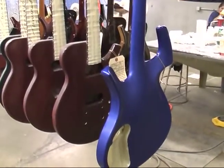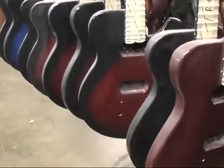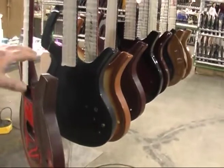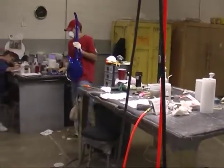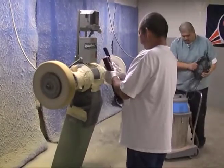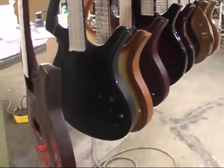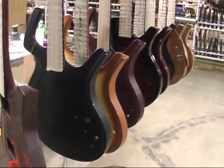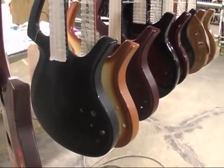From the curing booth they head to the wet sand and final polish area, where there's a long line of our new single-cut guitar that came out in January 2005, as well as Fly guitars. After the paint department, guitars come to this table where they're wet sanded, then buffed and polished. From here they go to another CNC machine, and you'll notice on these Fly guitars that the pickup cavities have not been cut yet. We are the only guitar company we're aware of that cuts these pockets out after the guitars have been painted, because we simply believe you get a better-looking finish that way.